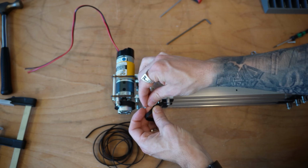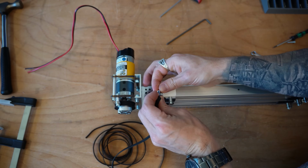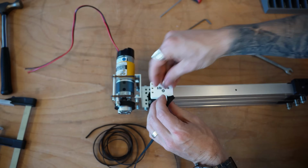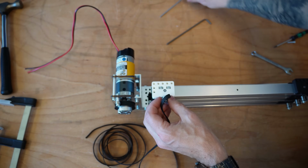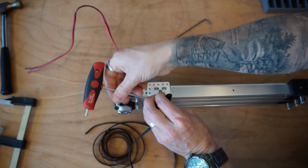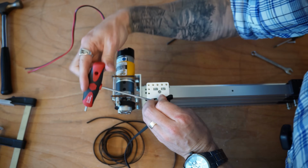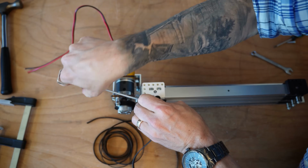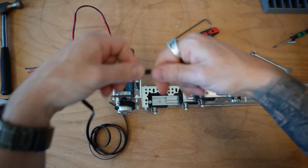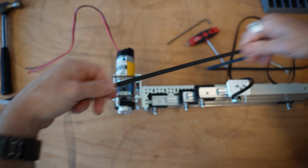We're going to slide this on through the back and give ourselves a few more teeth so we get a little bit of space. And then we're going to pull this all the way up. I'm going to give a little tension. I'm going to try to pull up on the belt here as I tighten this down so that we don't lose any tension on that system. Okay. Now we've got that holding on nice and tight. I'm going to straighten this out, make sure there's no kinks in my belt, because if there's any kinks in my belt, this system will not slide through.